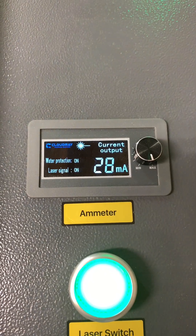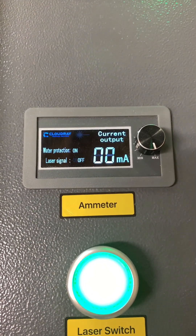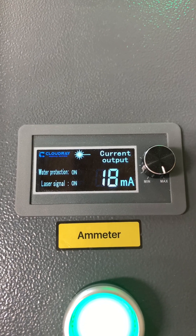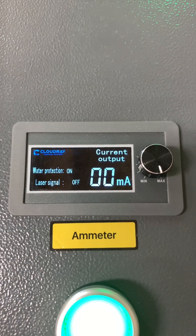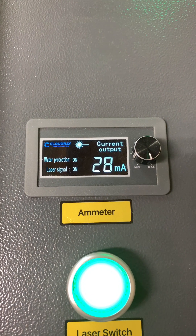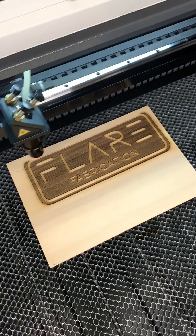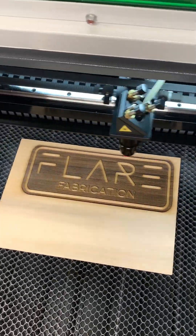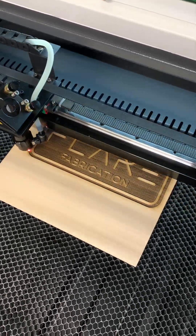Finally, the last thing I want to discuss is the maximum operating current for the laser tube. In order to prolong the life of any glass CO2 laser tube there's a particular maximum current draw which shouldn't be exceeded. The laser tube in my machine is a Reci W4, and the maximum recommended current draw is 28 milliamps. You can run tests with your laser, slowly increasing the power percentage until you reach 28 milliamps of current draw. For my machine it was right around 75 percent power, but every laser is a little bit different so it's good to run through this exercise with your own laser.